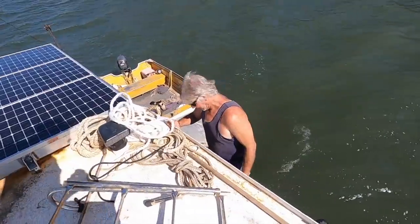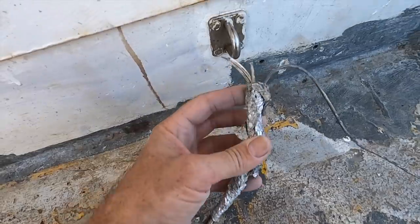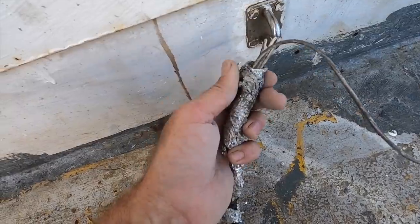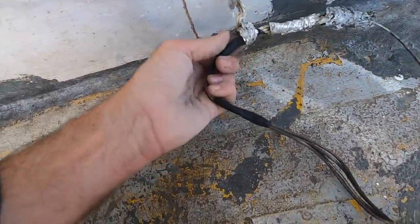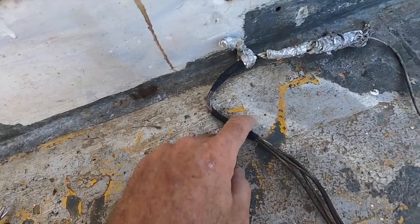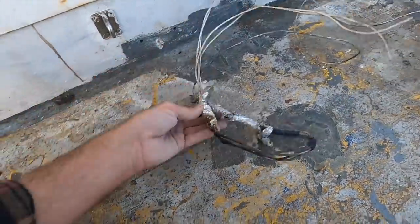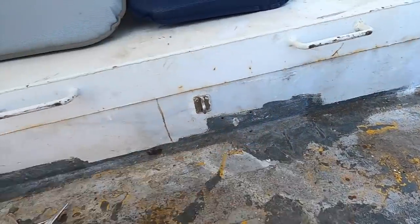We're going to come and grab a torch and have a little sticky beak. I started pulling broken wires through and then all of a sudden I could see this, and hooked it with the hook and just pulled all this out through the inspection hole I drilled. A bit of tape here. Old wires out and string in.